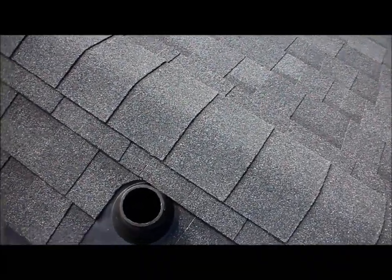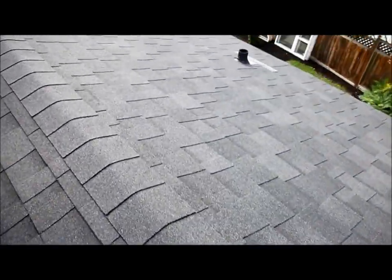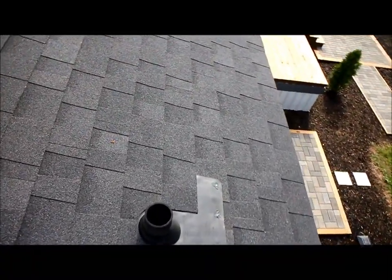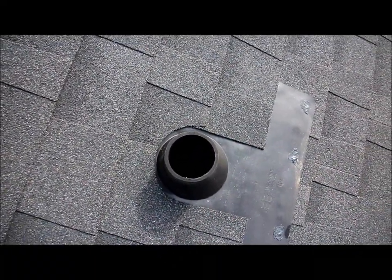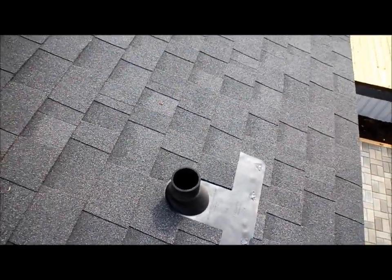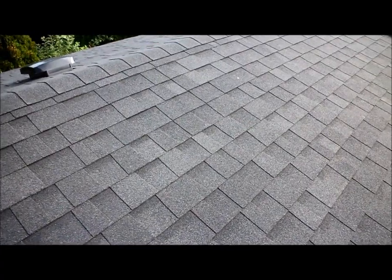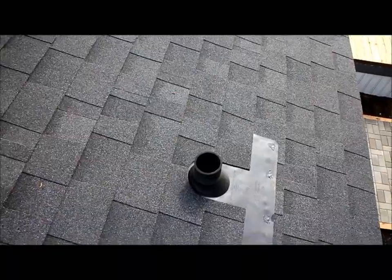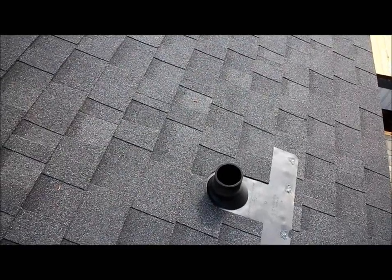This particular one is three inches all the way down. Often they'll have an inch-and-a-half or two-inch vent, and this one reduces down to a smaller pipe inside. They use the larger pipe on top to allow for frost accumulation in the winter so it doesn't get plugged. It also serves to vent exhaust gases — like sewer gases — so they don't enter your home. Any sewer gases that come back up the system will go up through that vent.